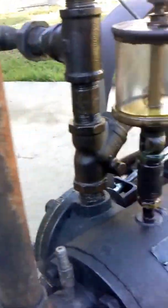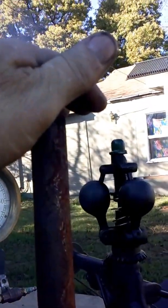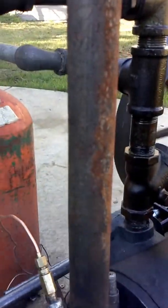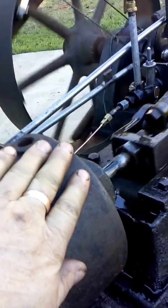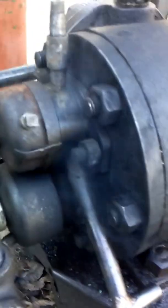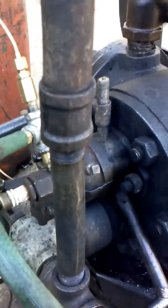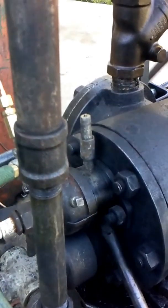It's running with a regenerator. You can see that the exhaust is not very hot at all — maybe 200 degrees. It's been running for probably an hour or more. The cylinder is pretty warm. The regenerator, or thermal capacitor, is right there. It's basically preheating the air with the heat energy that's stored in the exhaust.